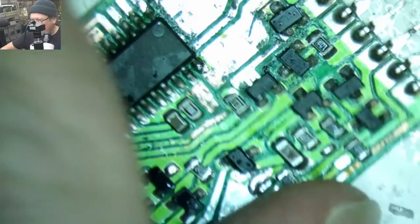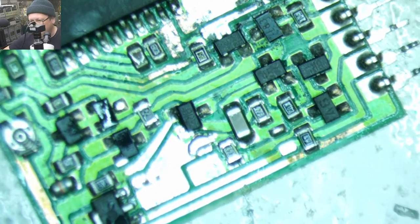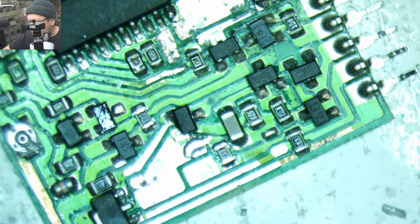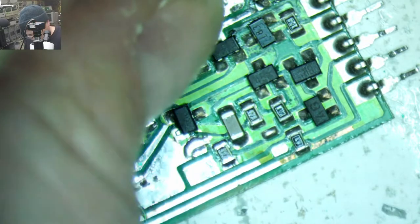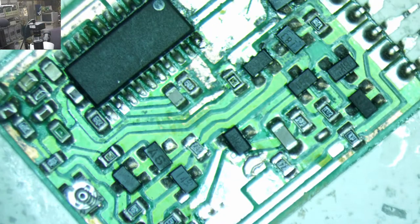Okay, this job is annoying as heck. All right, let's go to Bruce's guide. So let's put on this 33 microfarad 25 volt first, and this points. Oh, and of course, one of the corroded bits fits right in between there. So I'm going to put a little solder mask on, and that's going to take a hot minute.